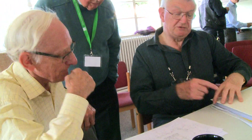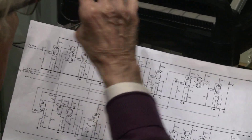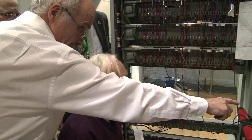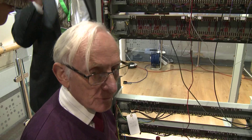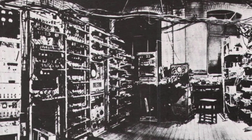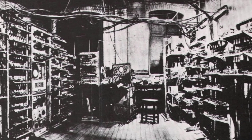They drift over time and don't really settle down until the machine's been running for 20 minutes, which is going to be inconvenient. So we had a long discussion about the circuit design. We'd copied an original document from the pioneers, but we're now convinced there's an error in that drawing, and we've got an idea about how to improve the circuit and make it work better. Interestingly, the circuits are fairly similar to those used by the pioneers at Manchester, who had their baby machine running as a laboratory prototype a few months earlier, and the correction makes our circuit much more like the Manchester circuit.